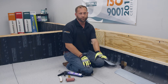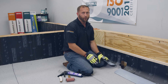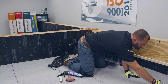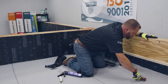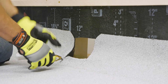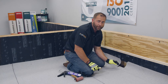The next thing we've done is brought our last course of granulated cap sheet up to the wall and extended it a minimum of one inch up past the cant strip. I'm going to now pull the release film and show you how I've made the cuts at the scupper. I put the flashing extending up the wall. When I got to the scupper, I made a relief cut from the bottom of the scupper up to the top on both sides, trimmed it out at the top, and cut it here to make sure we have enough membrane to extend into the scupper one inch past our Elastiflex SAV to get a good bite directly onto the primed metal.